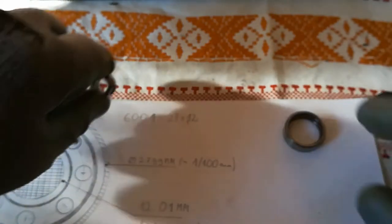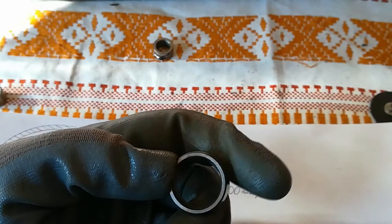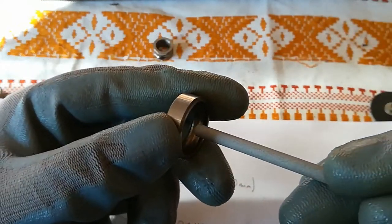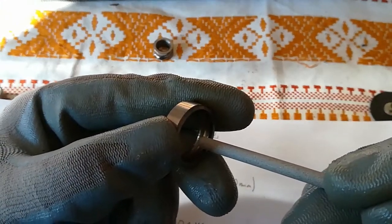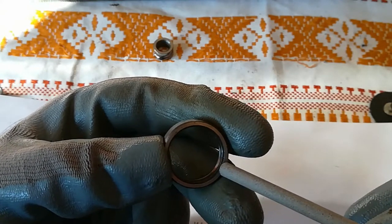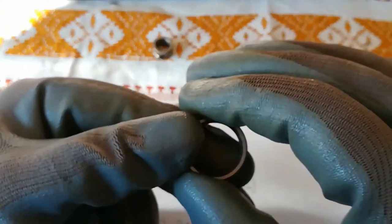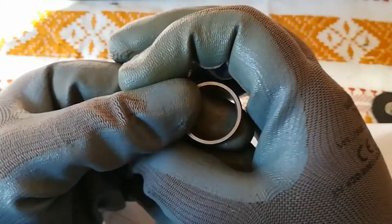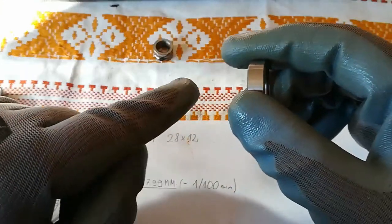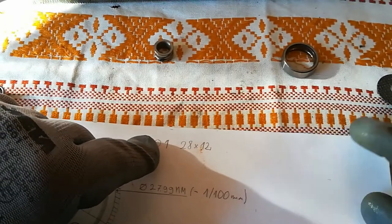That was the inner race — now let's go with the outer race. To remove the outer race, you are going to need to weld it. If you weld it like this, on three angles — here, here and here — weld it six times, so that's two triangles. When the weld cools off, it's going to shrink the metal and this bearing will come out. There is an interesting tool that you can make — it's very simple to make, so I will demonstrate to you.